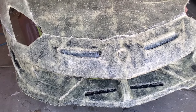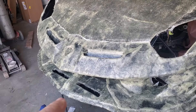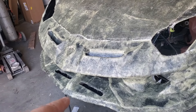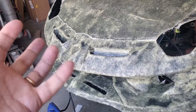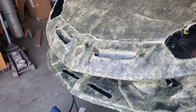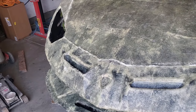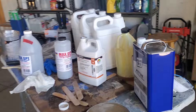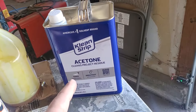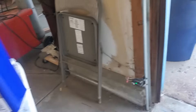It's kind of cool because when I was bedding the fiberglass into the print, you would see that the fibers would try to come apart — that's because the acetone was actually breaking down the binder. At least that's what the internet says. So what I've done recently is tried to thin out the epoxy with some acetone. This helps to wet it out a little bit better and it will also help break down the binder.